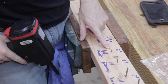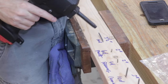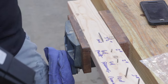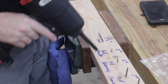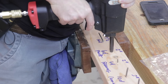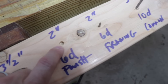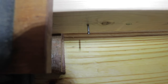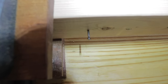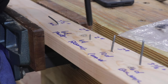I'm going to start out with this two inch finish nail. Basically what you do is put the tool over the nail, pull the trigger, and it should either knock the nail all the way through or at least far enough that you can grab it with your hammer. You can see it does leave a small mark in the wood, but it drove the nail far enough out of the two by four that I can grab it with my hammer or pry bar. Next I've got a two inch framing nail, so we'll see if we can drive that out.